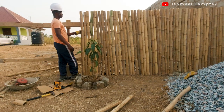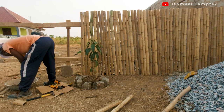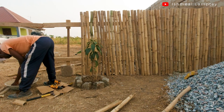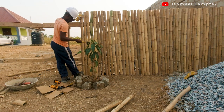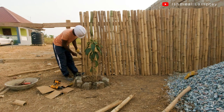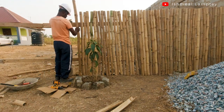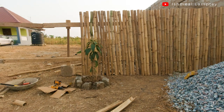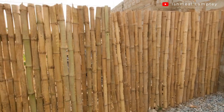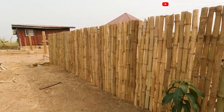I've had a good quantity of the bamboos driven into the wooden frame. Basically, I pick out the bamboo, put it to the position where I want it, mark it to the desired height, cut it, create holes with the drill, and then drive the nails with the hammer into the wood. At this point I had done the majority part of them.